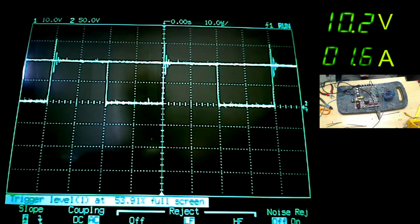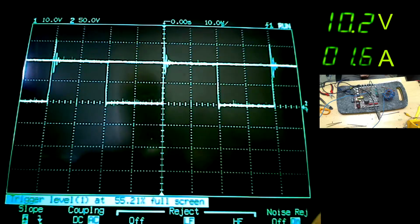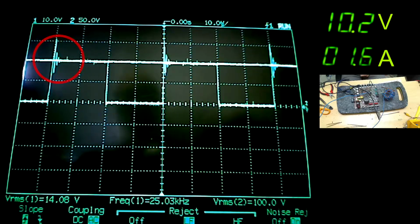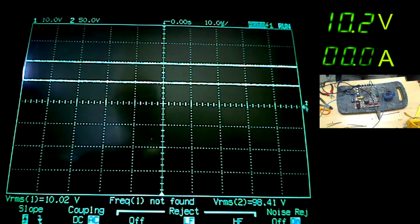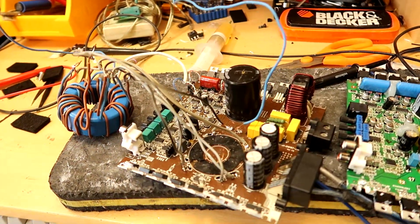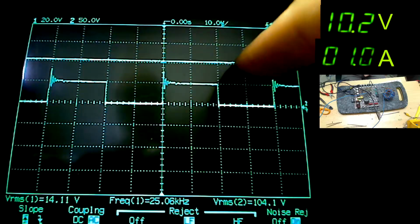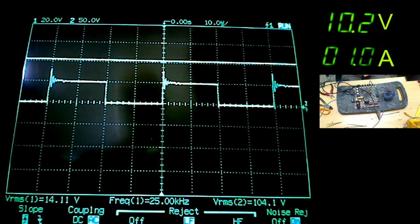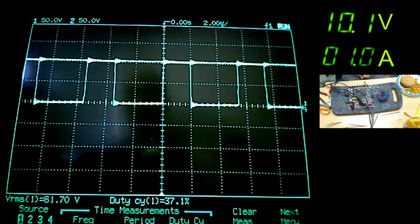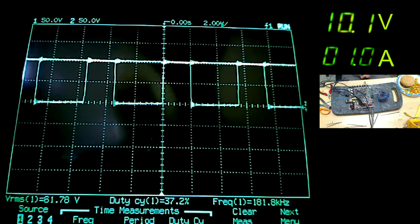With our new transformer core temporarily wound up, on powering it we can see the power supply drain waves here. It's a little bit ringy at the turn-on point, likely due to the quick, less than ideal test wind or extra cable hanging over the board here inducing noise, but working beautifully with the 14 secondary turns, giving us a near-on identical rail voltage to the Tyrants, with the output switching looking perfect and the amp drawing very little idle current. Great! First test complete, but now we need to crank this thing up and start preparing for a lot more rail voltage.